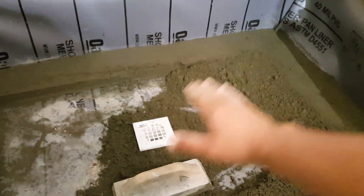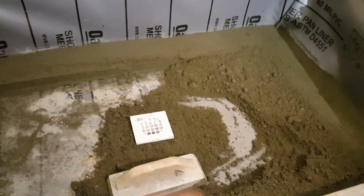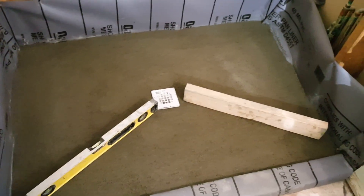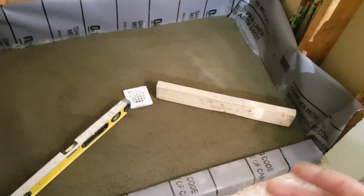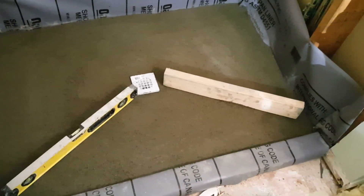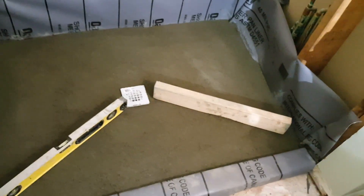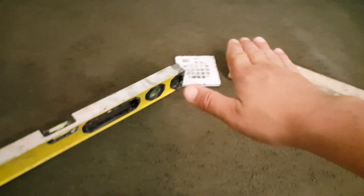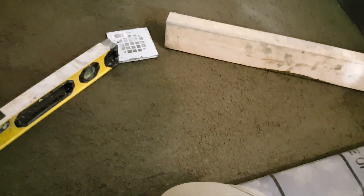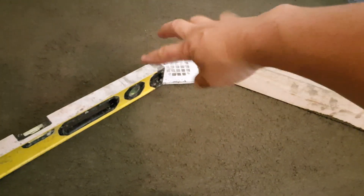To avoid any clogging on the weep holes — the small cavities on the bottom of the drain — you want to use pea gravel on the bottom to help with drainage. Just make sure you don't overdo this part because then you'll have a weak area; put it about three-quarters of an inch from the bottom so water that flows through little cracks drains nicely. The technique I use for leveling is to work the perimeter, making sure it's all at one and a half inches thick, then gradually taper that to a quarter-inch of inclination so you don't have a massive pitch that's hard to walk on.